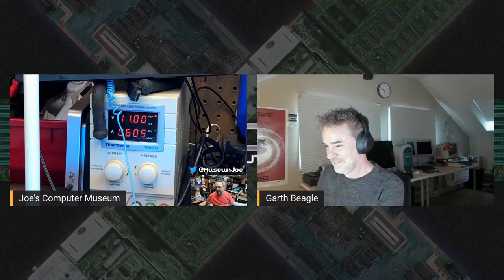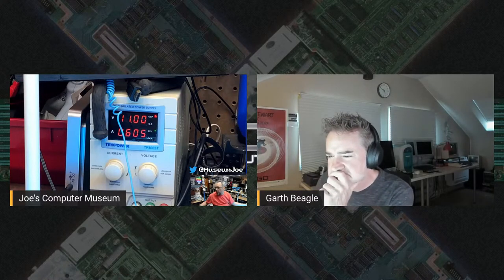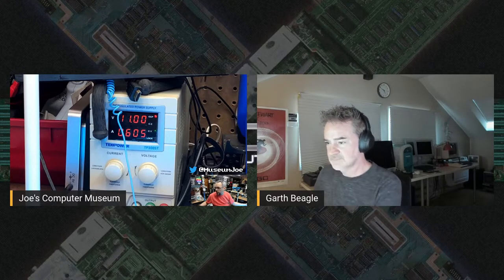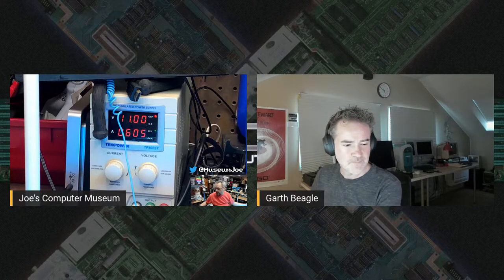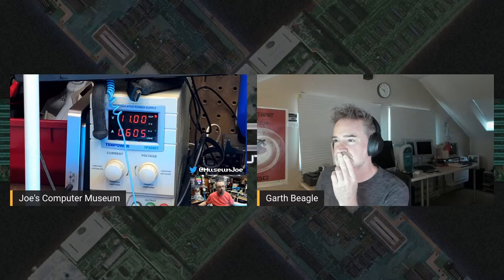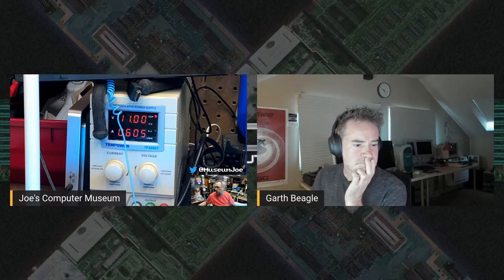However, that's not the wattage we have to worry about. It's the wattage it's going to drop from the 12 volts to the 11 volts. So it's basically 1.5 times, or it was 1.5 amps, right, before? And then we're subtracting 0.6, so 1.5 minus 0.6. So it's dropping 0.9 watts. So we need to put four resistors together, four quarter watt resistors together, to make sure we don't blow them up.